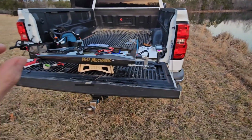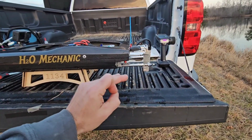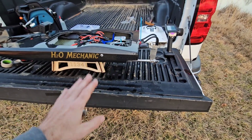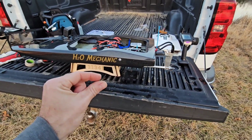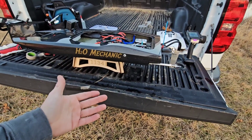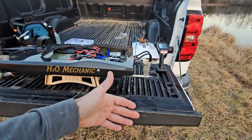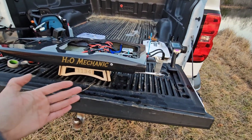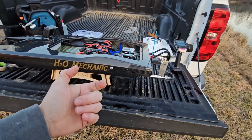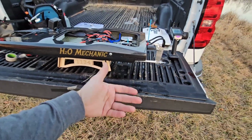But other than that, this thing aired out beautifully. I still have not ever adjusted the struts since I set them, and so far I think I'm just going to leave them like that. It does have an issue turning under power more than 50%. I think it's trying to push the rear end straight, and the rudder doesn't have enough to overcome it. Now it does still turn, but when I go from like 60% and I'm turning and I release the throttle and go down to say 40%, it really makes a more violent turn.